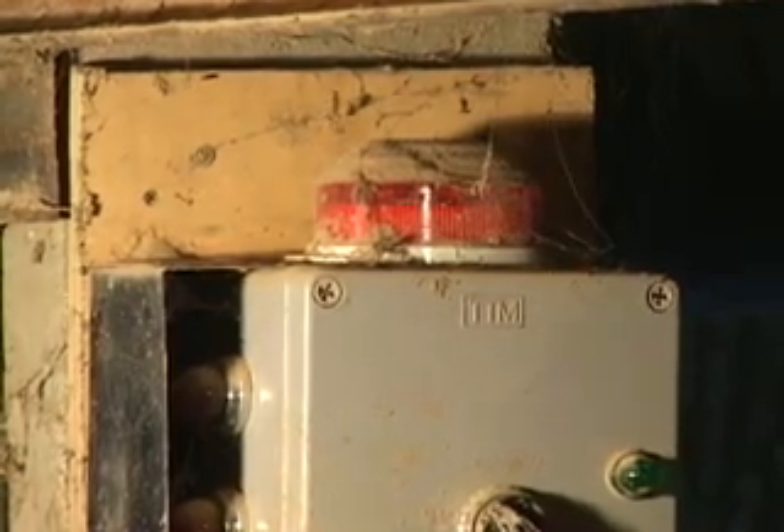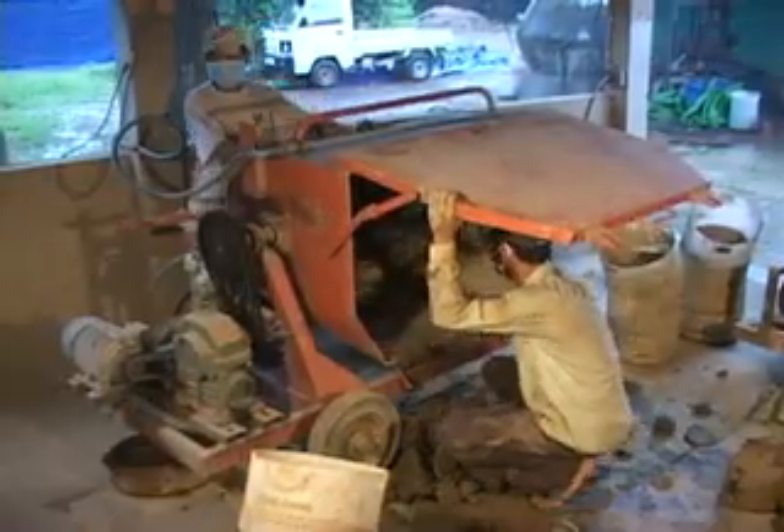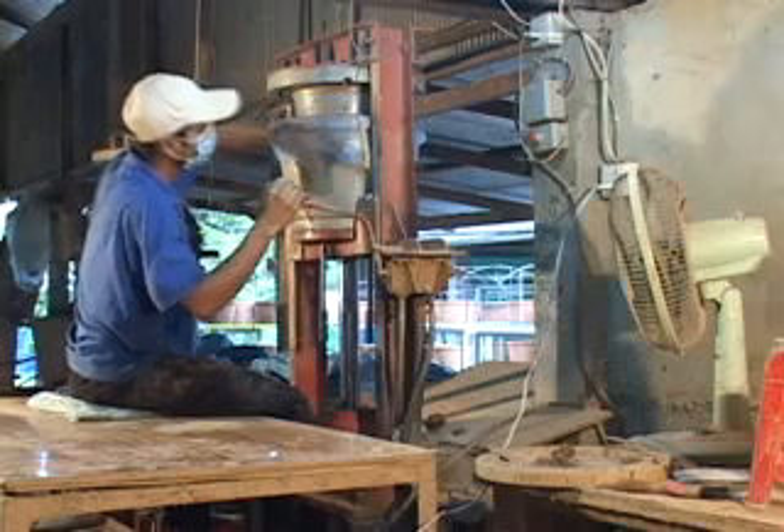After the 10-minute mixing period, the resulting clay mixture is ready to be put into the press. The operators remove the clay and weigh out approximately 8.2 kilograms. The clay is kneaded into a standard shape and then placed inside the hydraulic press. The clay is pressed by the mold into the pot shape and is removed from the mold by three ejection pins.